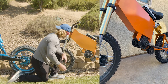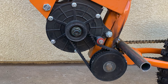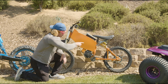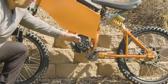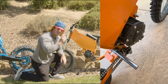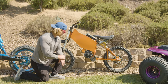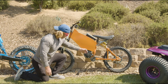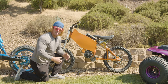Moving to the motor — this is a two-step gear reduction system, similar to what the Surron has. The motor spins a belt to a pulley, and I got the gear ratio to an end result of 8-to-1. I believe it's a 22-tooth to a 40-tooth, and then on the other side a 13-tooth to a 45-tooth — something similar to that, all coming to 8-to-1. That's perfect for bottom-end and top-end power. It's always best to have your higher RPMs on the belt system and lower RPMs on the chain — that achieves the best of both worlds.